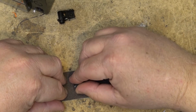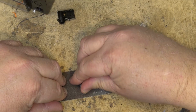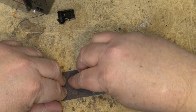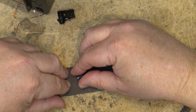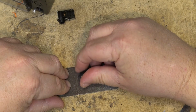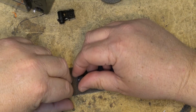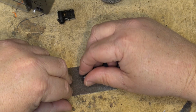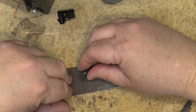Now, based on the age of this unit, I think the chances of finding a roller for it are going to be slim to none. But sometimes these rollers, if you just scratch the surface of them a bit, get the oxidation off, then the xylene mixture that's part of Rubber Renew, it's got xylene and ethylbenzene and methyl salicylate as the chemical makeup of this stuff. So you want to try and avoid getting it on your skin, because I'm sure it's not good for you.